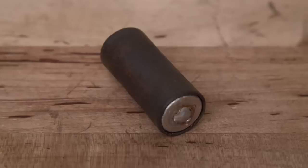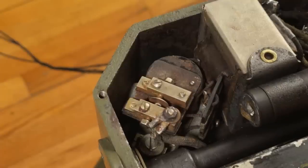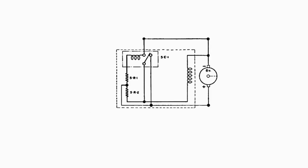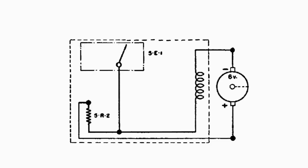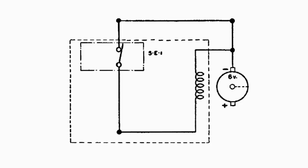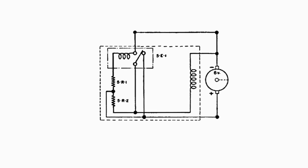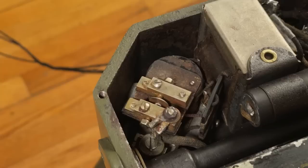The filter consists of a choke and a capacitor: an electrolytic capacitor on the low-voltage side and a large paper capacitor on the high-voltage side. The final part is the voltage regulator — an electromechanical regulator, essentially a relay. It implements a closed-loop voltage regulator using only mechanical parts and electromagnetism. When the signal from the low-voltage commutator exceeds an adjustable threshold, a coil in the regulator pulls a reed switch away from the normally closed position. In this state, a resistor is connected in series with the generator field coils, dampening the whole system. If this doesn't reduce the output voltage enough, the reed continues to move until it contacts the other side, shorting out the field winding and effectively turning off the generator for an instant. Because of the negative feedback provided by the system, the output voltage remains approximately constant even if the user turns the crank too quickly.